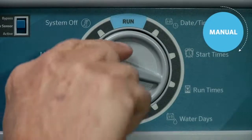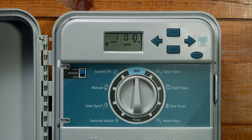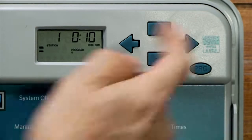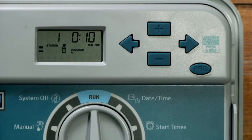We are going to skip Solar Sync for now and go straight to the manual position. From the manual dial position you can turn on a single station. Simply choose the station you want to start with, ensure that it has the desired run time, and turn the dial to run. The station will start running and you will notice a sprinkler flashing on the display. The controller will continue to water the rest of the stations with run times. If you want to turn off the stations before the manual cycle elapses, simply turn the dial to system off and wait a couple of seconds. You can also turn on a program by putting the dial in the run position and pressing and holding the right arrow until the screen changes. Once it does, you are given the option to use the program button to go to program B or C, or back to A, and just leave the display on its own and it will start the first station in the desired program. You will see the flashing sprinkler icon, and this will run through all the stations that live in that program.